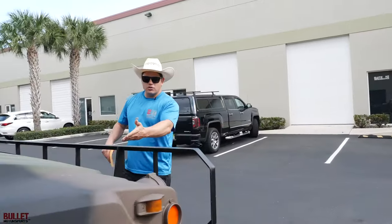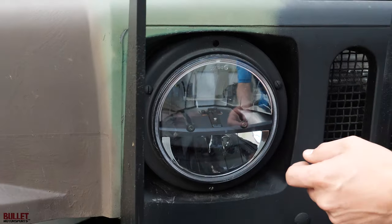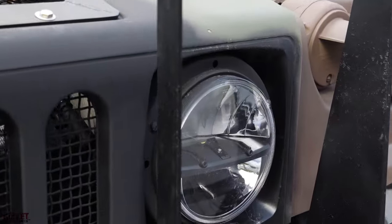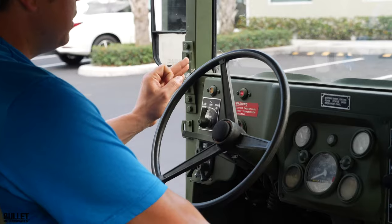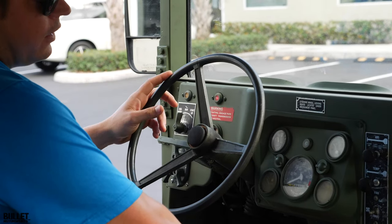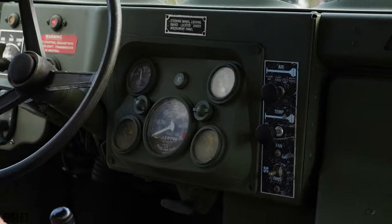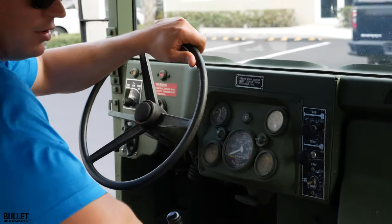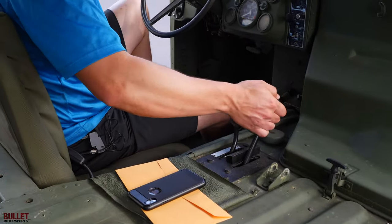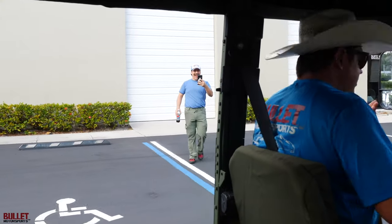Let's go ahead and jump in for a test drive. Our friends at Midwest Military Equipment hooked us up with some LED truck lights — the new versions — super bright so you can actually see at night. Starting it up now. Normally when it's cold the wait light will stay illuminated for about 10 to 15 seconds. Charging system is working properly — you can see it going to the green. We're at around 140 degrees, 50 pounds of oil pressure. Fuel gauge is showing almost empty and I believe that to be true. Hey Mario, jump on in — we're going for a test drive!